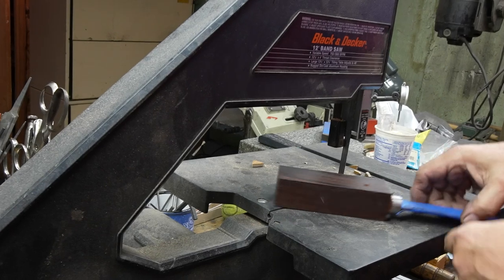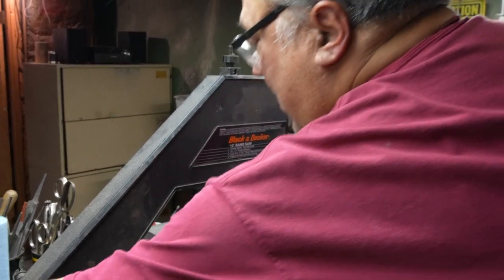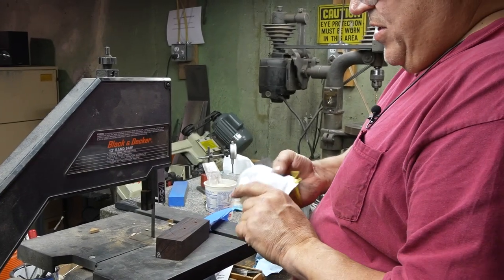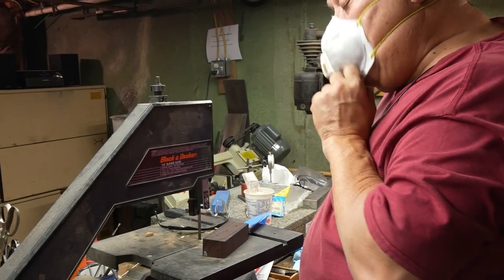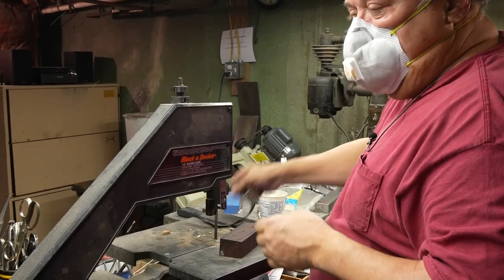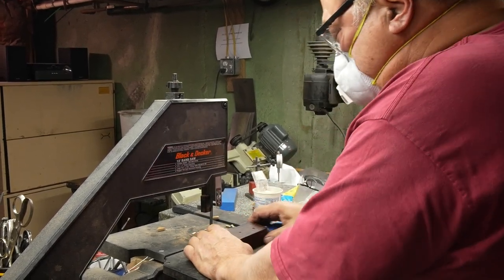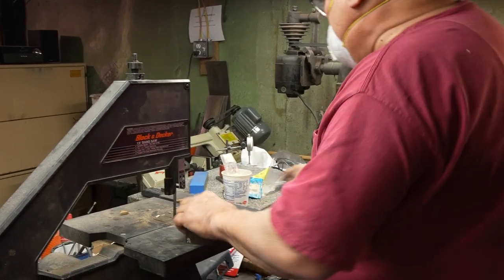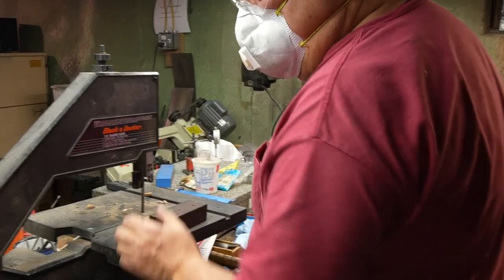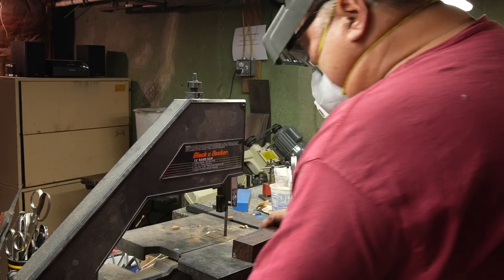In sawing, grinding, or working with Cocobolo, my recommendation is that you always wear a mask. There are two reasons. One, there's silica in the wood, which is a glass. If you do a nice clean cut on the end with a table saw and hold it up to hard light, you'll see little glints of glass in there. Two, besides the glass, there's maybe some allergen in there that some people get sensitized to. And once they get sensitized to the wood, they won't be able to use the wood anymore unless they want to put up with a lot of lung issues.